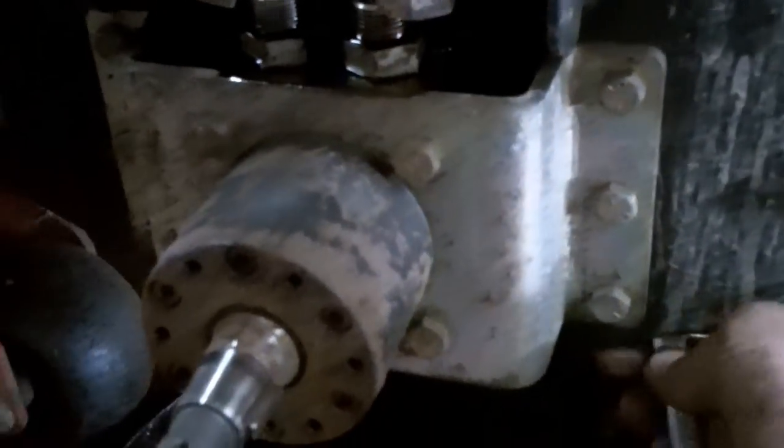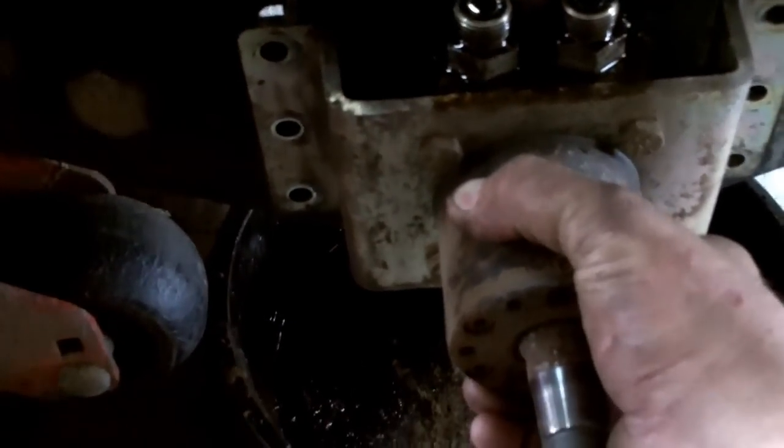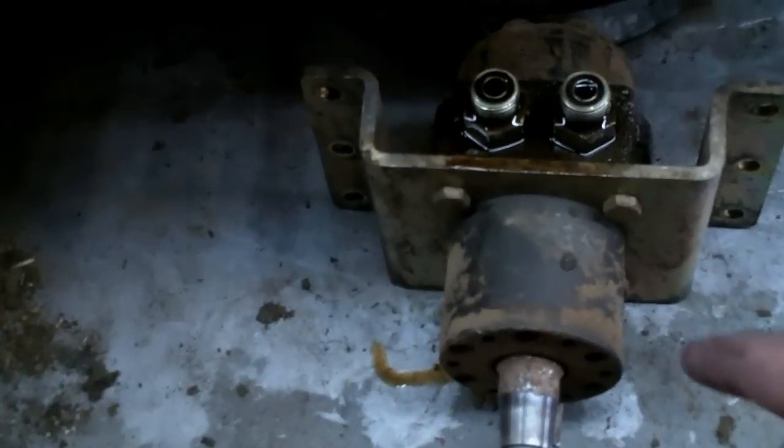To get these out, you'll need to look and get a backup wrench. You can go up under the back of the machine on both sides so you can hold the nuts while you turn the bolts out. Once you get all your bolts out of the wheel motor assembly, you should be able to just pull it straight out of the tractor. It's pretty heavy, so be careful. We'll swap out the wheel motor and put it inside this bracket and swap the fittings.